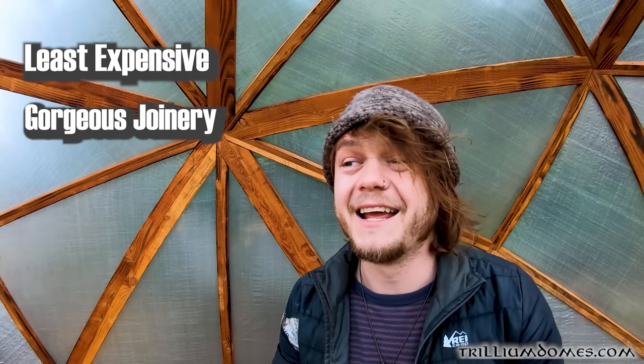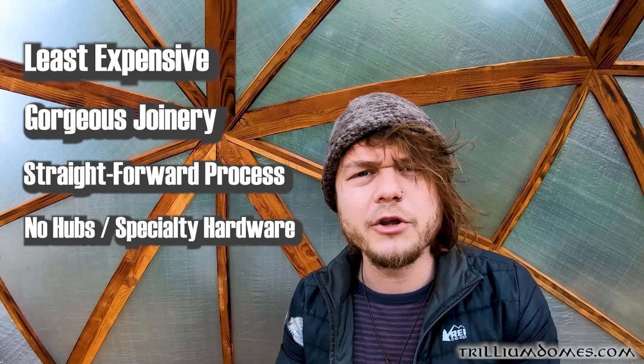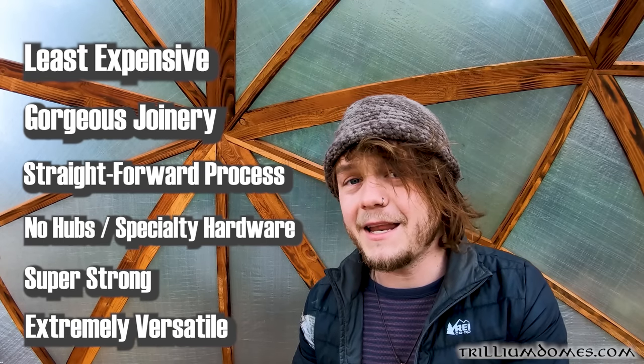This is by far the best, most versatile method for building domes. It's the least expensive, it has the most beautiful joinery, it's deceptively simple, there's no hubs, there's no hardware you have to buy. You can build a dome like this with a greenhouse cover, and in any amount of time, you can replace that cover with any material you want. You can replace it with polycarbonate. You can replace it with plexiglass. You can put a real roof on it and turn it into an Airbnb cabin. You can't do that with a conduit dome, and you can't do that with a dome with hub connectors.